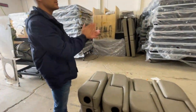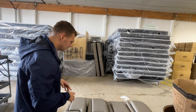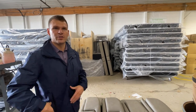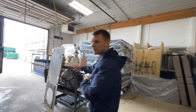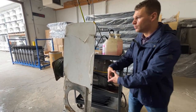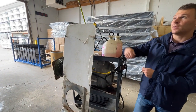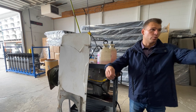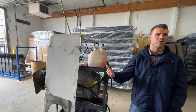Sofas, mattresses, and most appliances are put in after the sidewalls are on — so if you can get it in, you can get it out. The sofa and leather items are put in last, so workers with tool belts and drills aren't scratching up the leather surface. The final step is throwing this door on and then putting a big tube on it and blowing air throughout the whole entire unit. We have a spray bottle with water and soap and we pressure test all the seals — anywhere there's caulk around the windows, where the corners meet, everything gets pressure tested. If it bubbles up, we put more caulk on and fix it before it heads out.